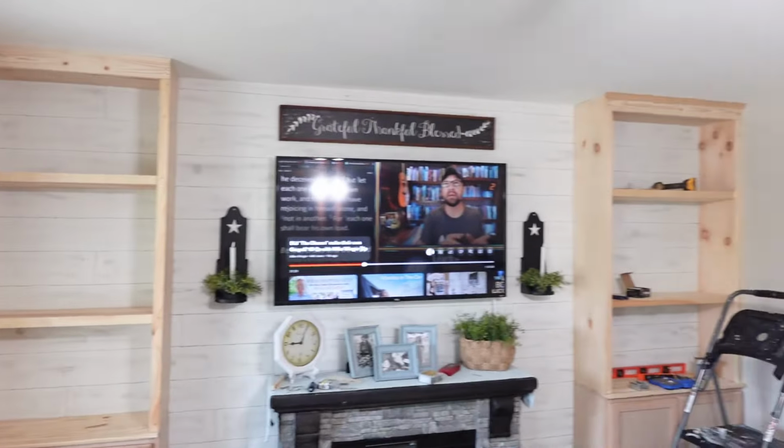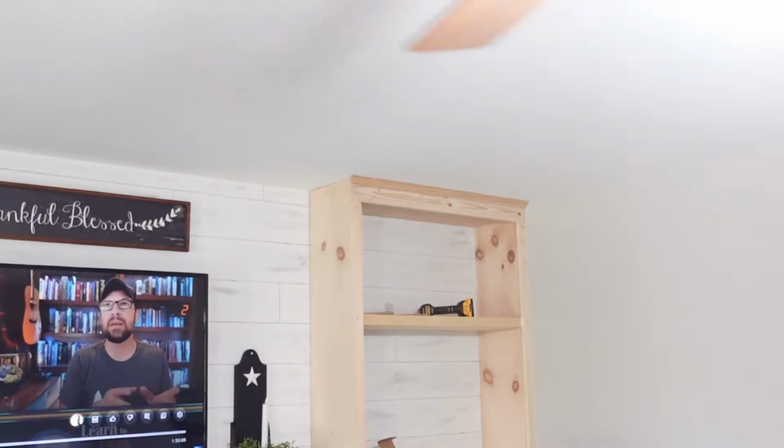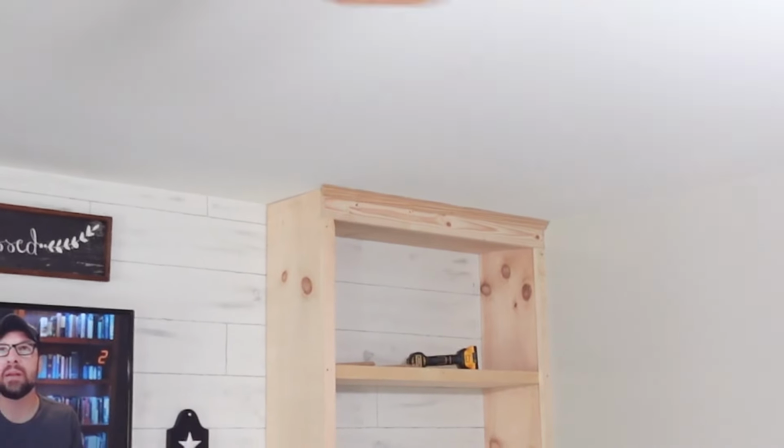He's just working on now the crown molding at the top, placing that. And then after all the crown molding is up, my job comes in because I have to caulk and fill in nail holes and screw holes, and cracks, and all that stuff to get a seamless look. Then I'll let that dry, come back in, do some sanding, clean it off, and then I can start on the backing